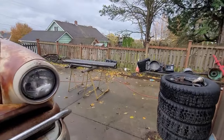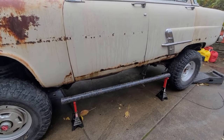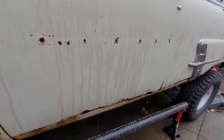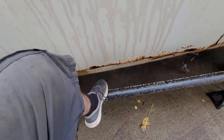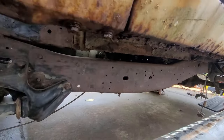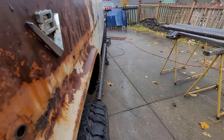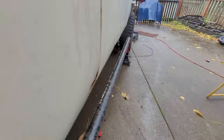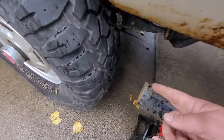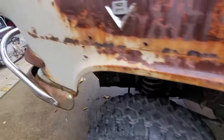We've got this set up a little bit. The pipes I showed you before — obviously that's too low, the jack stands aren't tall enough. These are going to become a nerf bar — we'll bring them up to about there and attach them back to the frame underneath, from the rusty old truck frame to the rusty old car frame. I've angled them on purpose just a little ways out so that if it hits an obstacle, it kind of pushes it away from the tire. Then have it just a little bit inset — I'm going to cut this and probably cap it so if it hits anything it's a deflection.